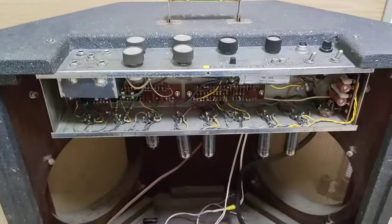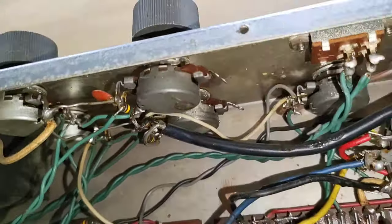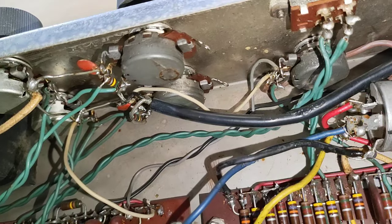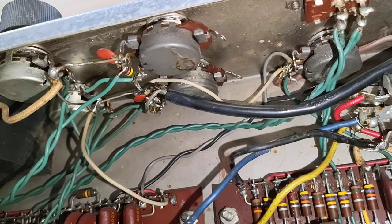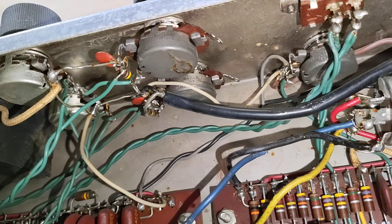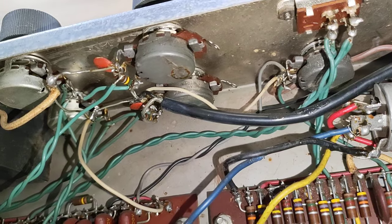And I'm happy about this because, as you can see here, there are two potentiometers here. Both of them are 2 meg, which is very uncommon for amplifiers. And not only that, but these are reverse audio with a center tap.